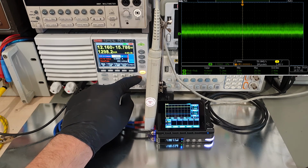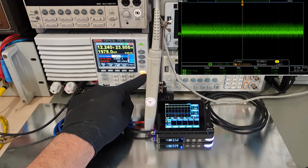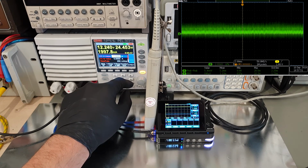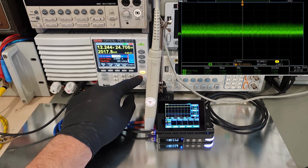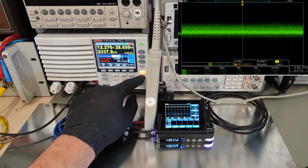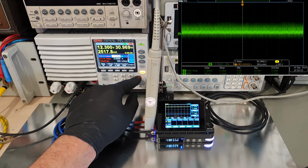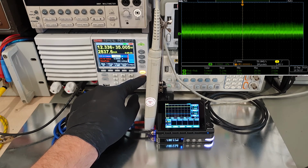For comparison, some high-end multi-thousand-dollar lab bench power supplies can guarantee you sub-microvolt ripple and noise. But none of them are this cute. None of them will get a range of expansion modules, and especially none of them will be partially open sourced. I'm now a little bit taken aback by this over voltage at high current behavior, but otherwise I'm very impressed by this thing's performance.